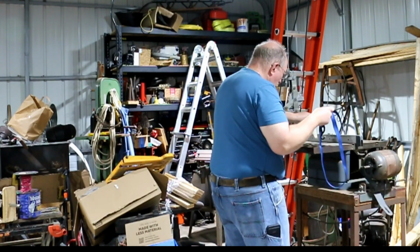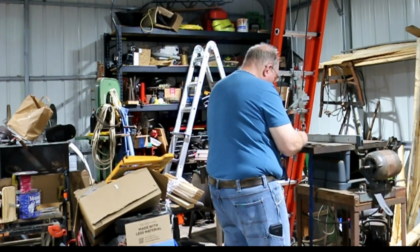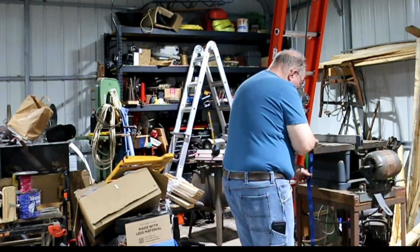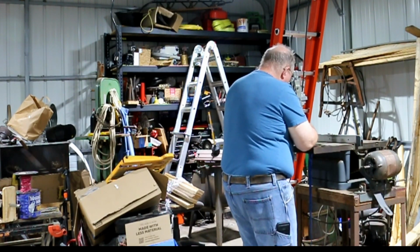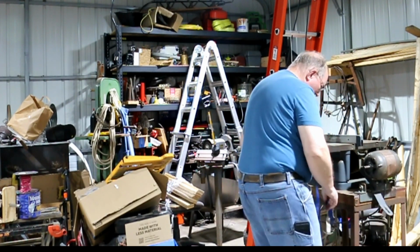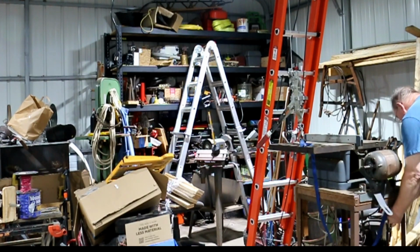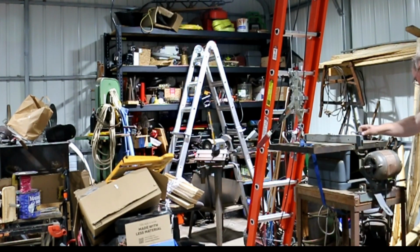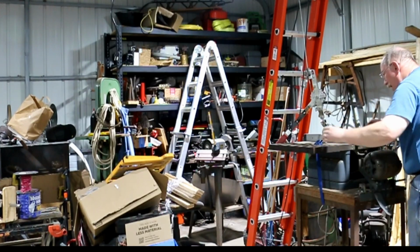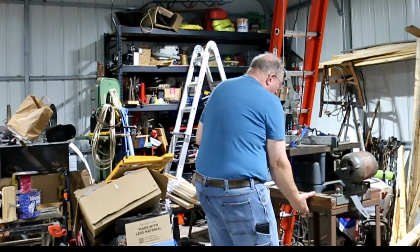Now I'm going to put this down through the center of this wing, because the wing is an attachment, but it's not very strong. Let's see, so I can hook that on there and just slip this around and catch a hold. Cast iron takes a whole lot of compressive load. Not a problem. But it doesn't do well if you've got a load under tension.